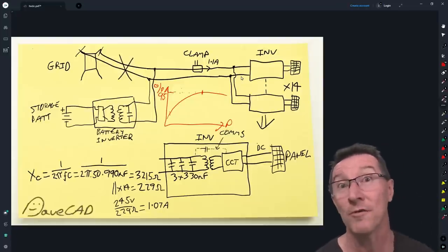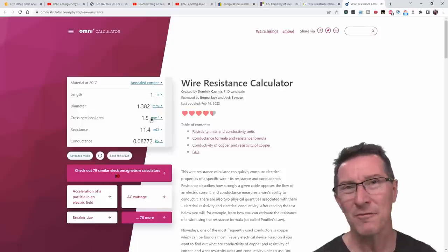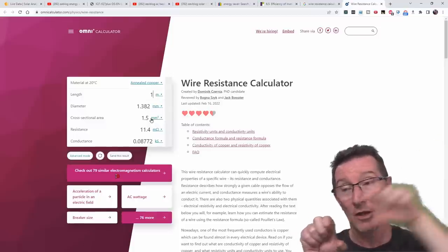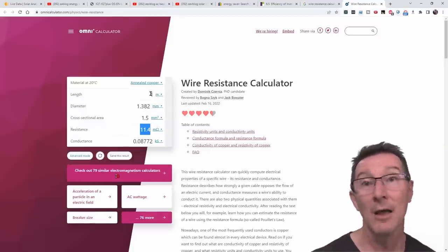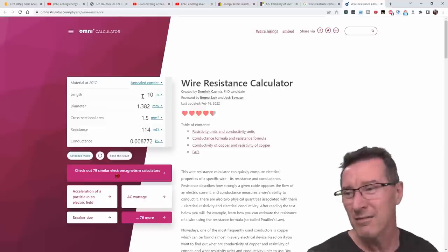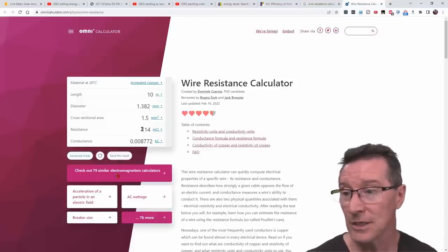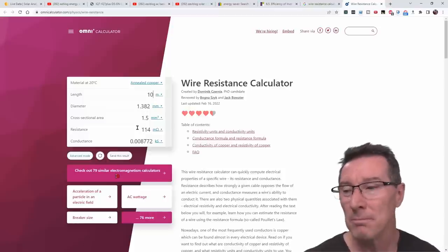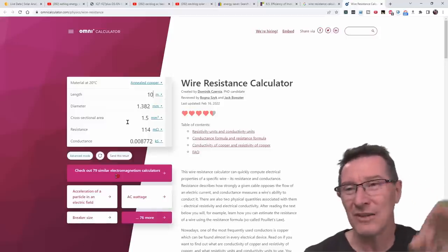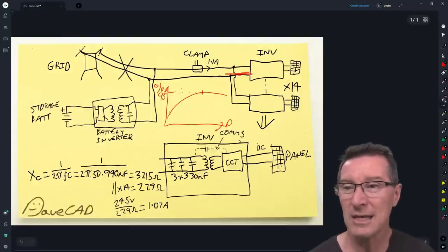Let's quantify the I²R copper losses. We've got copper at 20 degrees C, per meter, with a cross-sectional area of 1.5 square millimetres — I believe that's the size of the radial cable, which radiates out from your junction box. That's only 11 milliohms per metre. But you have to double it — so about 22 milliohms per metre, or 220 milliohms over a 10-metre run. The losses are I²R: one amp squared is still one, times 0.22 ohms — you're talking about 220 milliwatts real power loss for a 10-metre run at one amp. It's not a lot, but technically it's there.